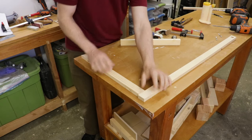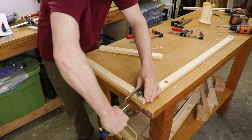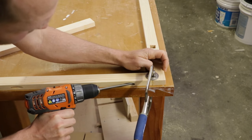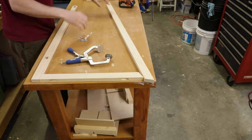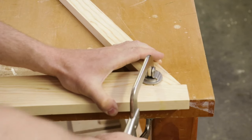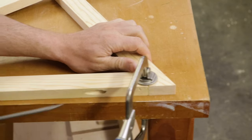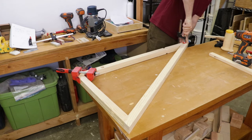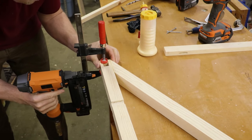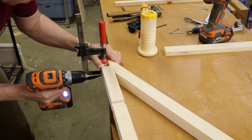To start the frame assembly I'm going to join the horizontal piece to the vertical piece and ensure they're nice and flat with a straight edge, then clamping them together so I don't have any movement. I do this so that my pieces can be easily repeatable since I want both frames to be identical. I've adopted the mantra from the fictional character Benjamin Martin in The Patriot played by Mel Gibson — aim small, miss small — so if I want these pieces to be as identical as possible I need to aim as small as I can. The third joint is not going to be connected until one frame is completely done, and then I'm going to take both frames and stack them on top of each other and clamp them down so they're locked in similar shape. With them locked down I'm going to join that last joint on the top board with a bit of glue, lock it down to the exact angle of the first one with a brad nail, and finish it off with a single screw — and this doesn't need to be a pocket hole because we're not going through end grain.